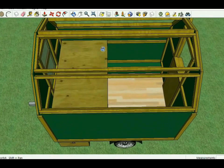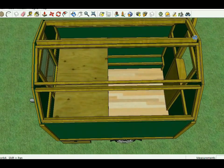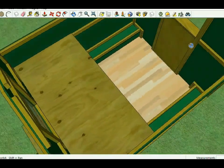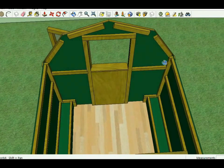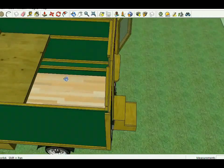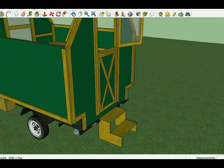The construction uses two-by-three or two-by-four framing with plywood or other exterior material. The roof framing is a simple octagonal barn roof style with the top boxed in. The wall panels are plywood attached directly to the floor framing so it's all one unit. Because the solid plywood panels support the sides, you don't have to worry about the sides sagging — a common problem with other vardo designs.